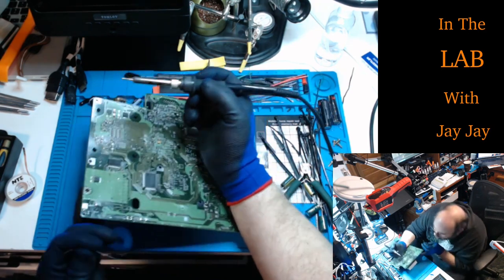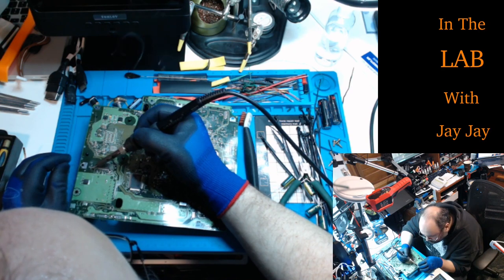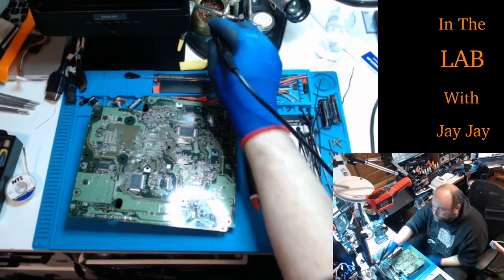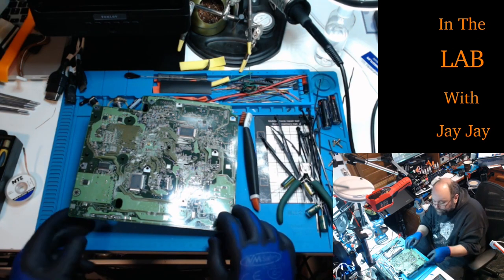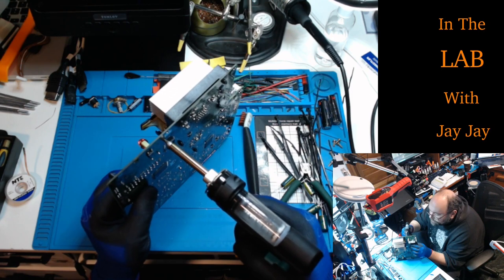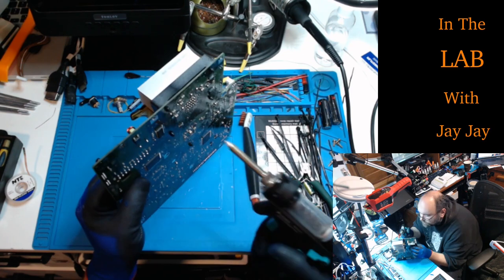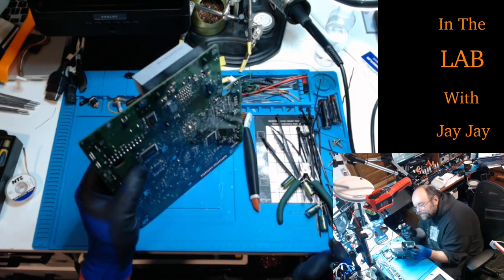So checking that we've got it. I'll put him in there. Okay. Add some solder. Alright. So this guy is up at 375. Put some fresh solder in our holes. So let's see what we can do. Yeah, that worked really quite well. Yep, so the combination of fresh solder and putting the temperature up to 375, that definitely helped.